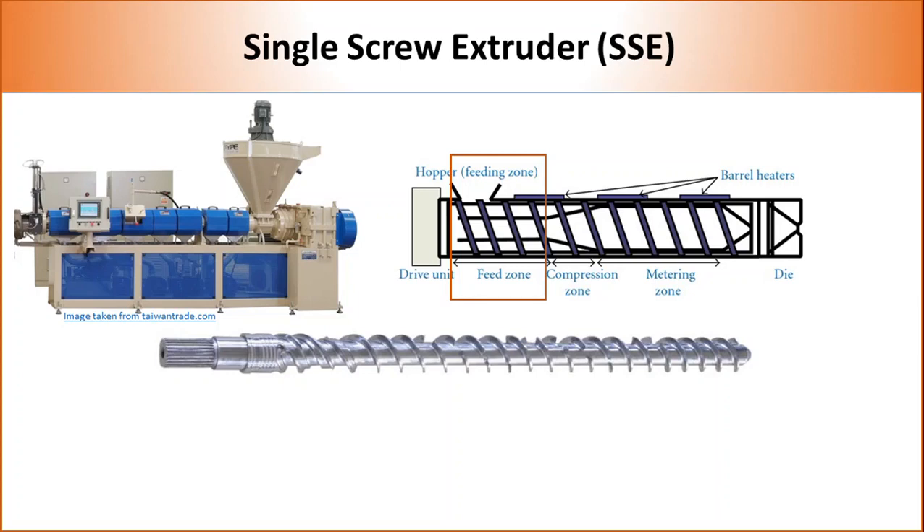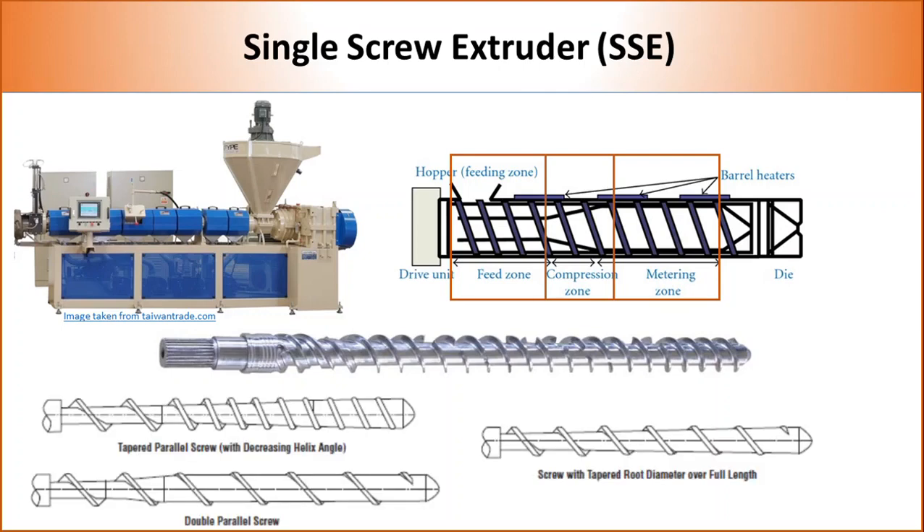Back pressure is the most important factor controlling flow of polymer inside a single screw extruder. The second zone is called compression. In this section, flight depth gradually decreases, allowing the polymer melt to get compressed and release any volatile material. The third zone is called metering, where flight depth is very narrow, creating high shear and helping additives to disperse in the polymer matrix. The relative length of each zone depends on the polymer's melting behavior and the viscosity of the polymer melt.